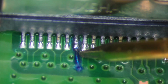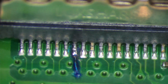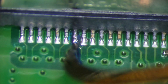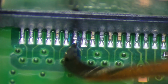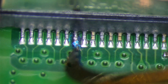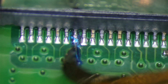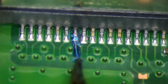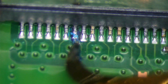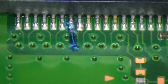We have resistance value on the trace. We just don't have it from here to here. So just out of curiosity, if I scratch back just a little bit, I'm wondering if this guy over here somehow just broke. Like the connection, you know? So the pad is there. So we'll test around this area to see what connections are still viable.